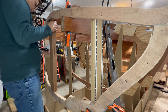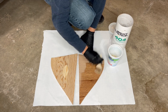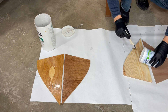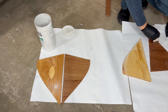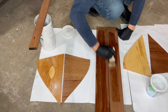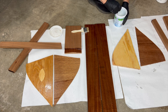The king board, which is in the center of the transom, is one and three quarters inch thick, so I make this by laminating two boards. Notice that it butts up to the keel pad. Now it's time to permanently bond with epoxy. I wet the plywood and the end grain of the hardwood boards with unthickened epoxy. While the surface grain of the hardwood did not need to be pre-coated with unthickened epoxy, I forgot and did it anyway.